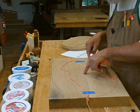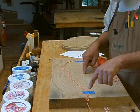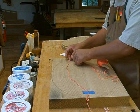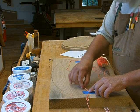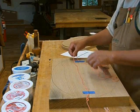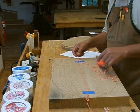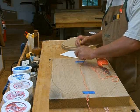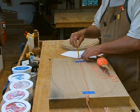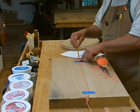Now you take that 8 inches and measure from your center right down the center line 8 inches and make a mark. Do the same thing on this side. Then take your string — I use tape to simply tape one end so it'll pivot around at that mark, and the same thing with the other end. The question is how long do you make the string? You make it so that when you put your pencil in the loop, it comes right out to the end of the major axis — to where you want the ellipse drawn. Then tape the string down.